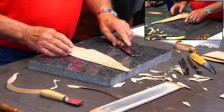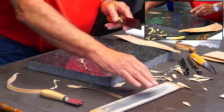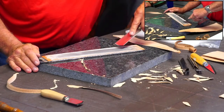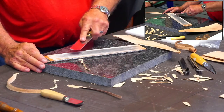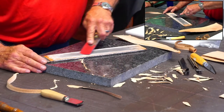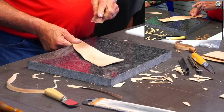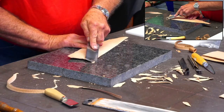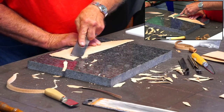I feel like maybe we should go over buffing a little bit or doing some stropping. That is a really fine edge. I'm cutting this, but if I started having trouble with it, I would take my strop and strop it. Now this is a curved blade, so if I just strop this way, I would only be getting one part of the blade. So I'm going to go like this and get half the blade, then like this to get the other half. Just like you're putting butter on a piece of toast. If you ever strop a blade after you've been cutting with it and then strop, you will be definitely surprised what it does for you.